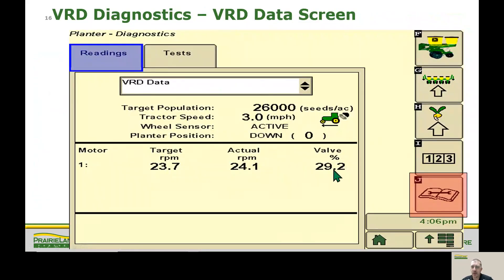To give a quick diagnostic scenario: say we have 100 percent valve position and zero RPM and we're not planting. There are two scenarios. First, it could be that we don't have the hydraulics plugged in or turned on – the valve would be opening all the way but we'd get no RPM. So we'd want to check our hydraulic hoses and then our plug-in for the valve. The same readings – 100 percent valve, zero RPM – can also happen with the set screw coming loose, but the key difference is we'll actually see our motor turning. That's just a couple of scenarios we can use this page for to diagnose where our problem is.